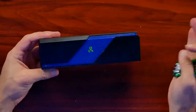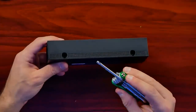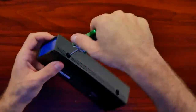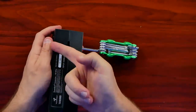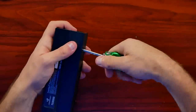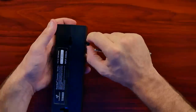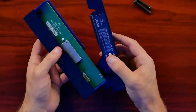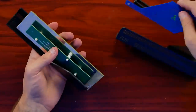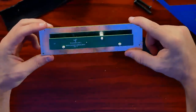Now onto the power brick itself that transmits the wireless power to the grip. It looks like they're using fairly large torx screws on the bottom — this appears to be a T25. From what I can tell it goes from here all the way up through the top, so they only have really two larger screws holding this thing together. It's pretty light, so I have a strong feeling most of this is just one big antenna. That top part comes off — it was pretty easy to see which parts were sections.